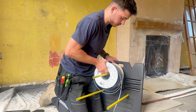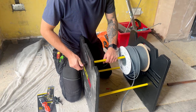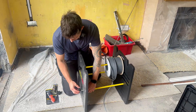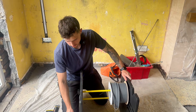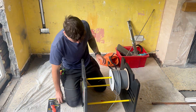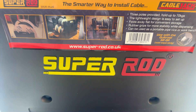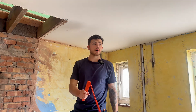You just screw them in — that's all of them. Get your cable on, and obviously you can put multiple cables on if you want. What you could do — like I've got to run 2.5mm, 6mm, and 1.5mm — you could get a lot of the drums on at the same time. When you run them off it just makes life a hell of a lot easier than pulling off the drum. You've all been there where it's a nightmare trying to pull in cables on your own and they're on the floor, cables going everywhere, kinking. I'll leave a link to this somewhere below, but I'm not really sure where you can buy it from — maybe pick it up from your local wholesaler.